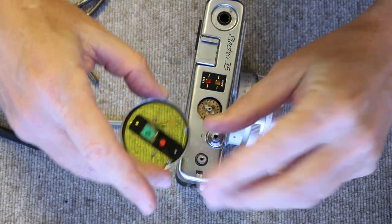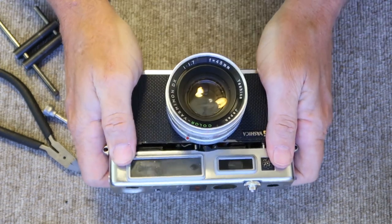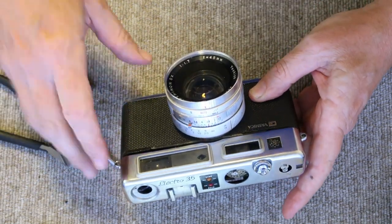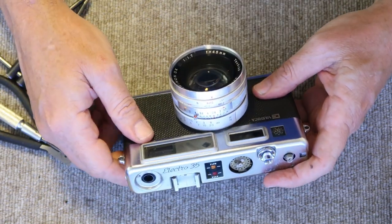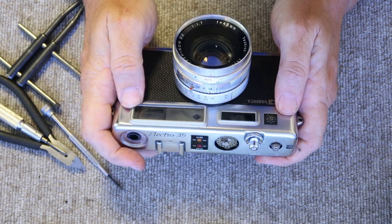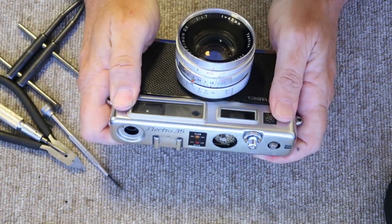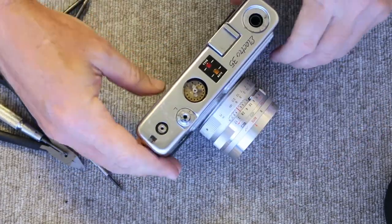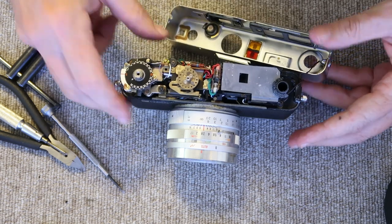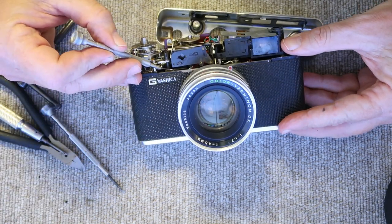I put everything in an old filter like this — that keeps it organized. Next thing to do is lift off the cover; normally it just lifts off. Sometimes when the camera is put together at the factory they use a rather strong glue to hold on the leatherette, and sometimes the glue comes up underneath the top cover and glues it into place, making it very difficult to get off. You can get it off by rocking it, or use lacquer thinner in the gap on the front and let it sit for about 15 minutes. So we'll lift off the top cover and there will be a wire here which attaches to the flash sync section on the top of the side cover. And looking inside I can see the pod right here is rotted away — I completely expected that.